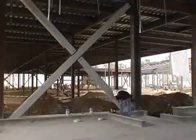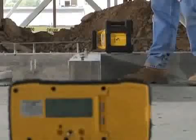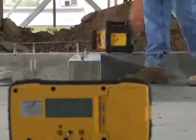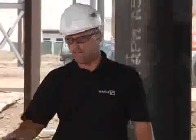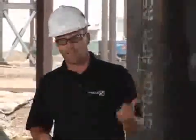So what I'm going to do is I'm going to put my hand down on that chalk line and I can kind of tell what side of the chalk line the laser's on right now. It's telling me that it's on the right side of the chalk line right now. So I know that I have to steer left. It's as simple as taking that left button and turning it that way. So I'm going to push it until I hear that receiver start to beep.